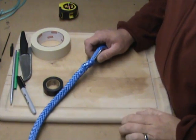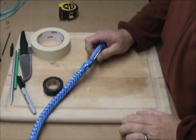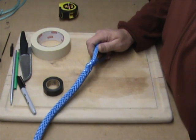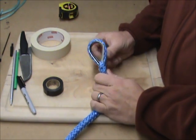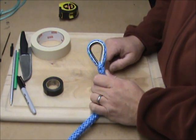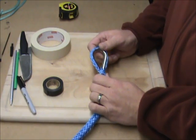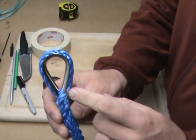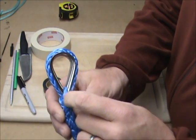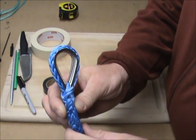This is going to be part one in a three-part series of showing people how to repair their synthetic winch ropes. It's really not that difficult. The first one is going to be replacing a thimble if you have an open thimble in your eye and it's gotten damaged or it's elongated. You really should replace it because what can happen is as it continues to elongate, this can bite down into the brummel and eventually cut the rope.